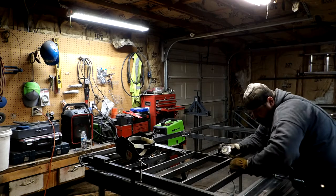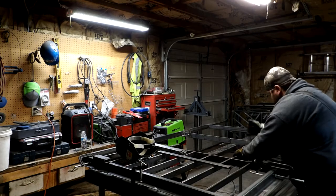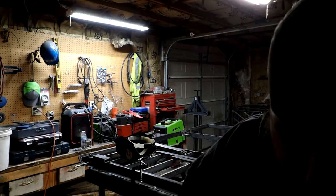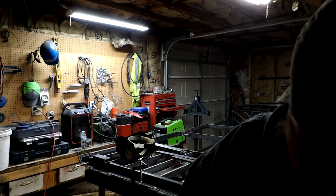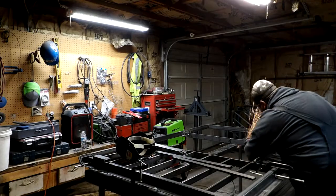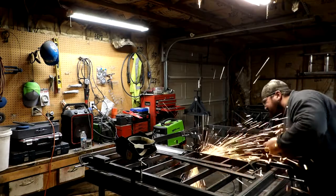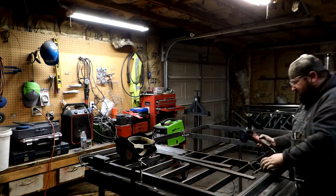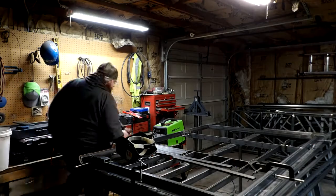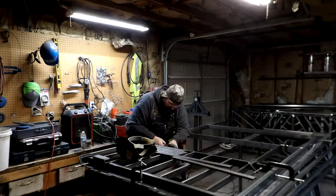And what I've noticed, as you see, I've got an open table. And so what I ended up doing is I was having a problem. I put one of my first pieces in a little bit crooked. I was using the spacer, yes, but it was still crooked. And then when that happens, as you continue to go down the line, as I would put it, it starts to cheat your measurement, maybe only a 16th apart, but by the time you get down 5 or 6 pieces, that could be 5/16 or a 3/8 different in spacing and visual lineup with all of your infill pieces, which doesn't look good.